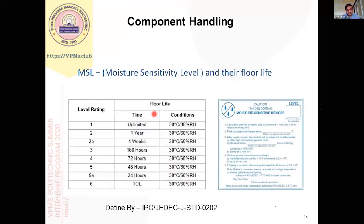Similarly, another hidden enemy is moisture. These very fine-pin components and ICs normally absorb moisture. When the manufacturer ships the component, it is specially packed in a vacuum-sealed pack. When you open this component for assembly, it immediately starts absorbing moisture from the atmosphere. There are different types of components that absorb moisture at different capacities, and IPC has standardized different categories of components depending on their moisture absorption level.